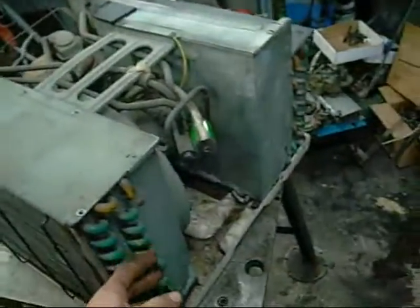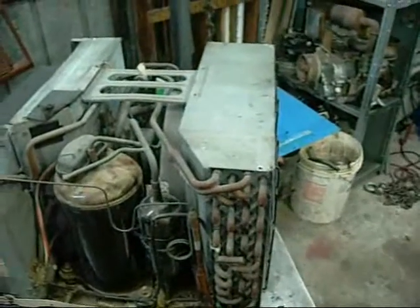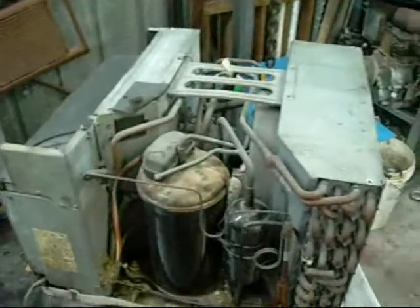It's only when you turn the thermostat back and let the fan run for a while until the pressure is normalised slowly. I always let mine do that except for that one there. Unless it's already on its defrost cycle, there's no way I can throttle it down before switching it off. So you always get a nice thunk thunk thunk and then hiss while the compressor is trying to equalise. I'm just looking at my outdoor heat pump at the moment, which is almost due for a defrost. Some of the rows haven't frosted over yet, but they'll get there.